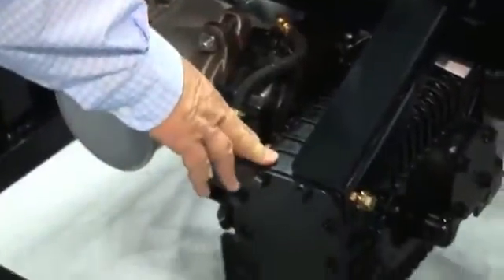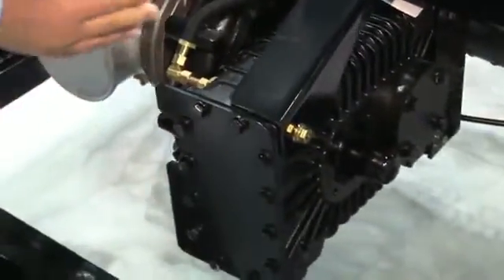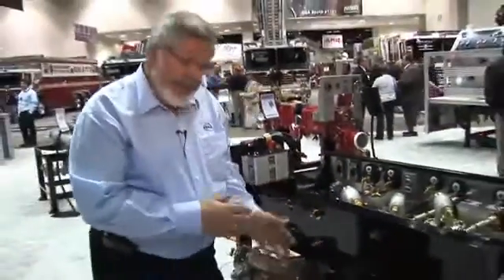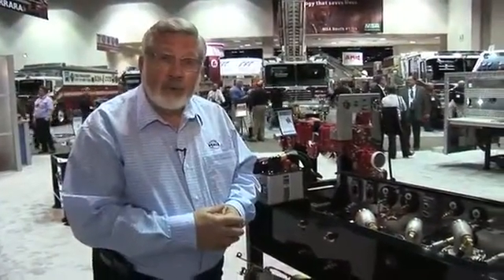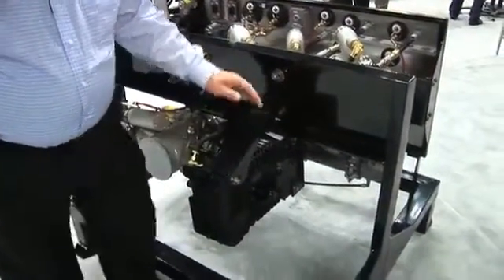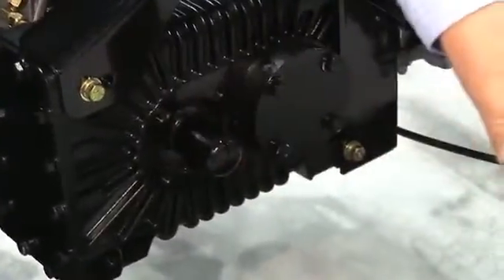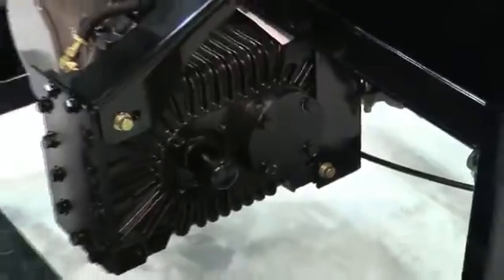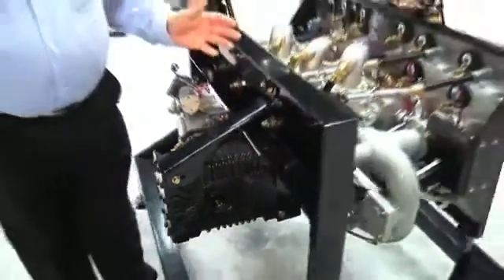This has the new silent series gearbox on it, which gives us the opportunity to quieten the gearbox down. It also has helical cut gears instead of the straight cut gears, which allows for much better performance and a quieter performance. This unit can be ordered for any truck. It's PTO driven — this is your PTO shaft going to your PTO on your truck. Very nice compact system, very user friendly and very installer friendly as well.